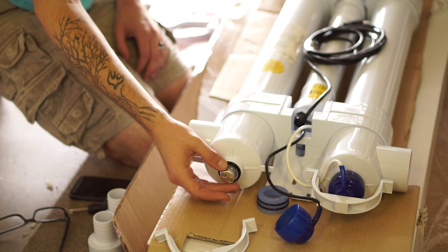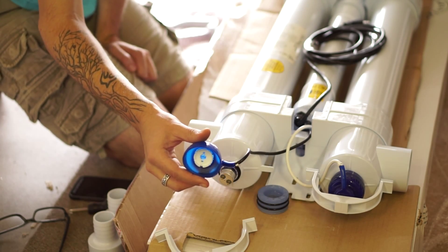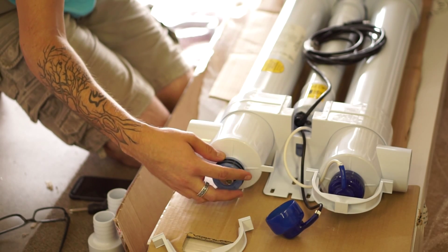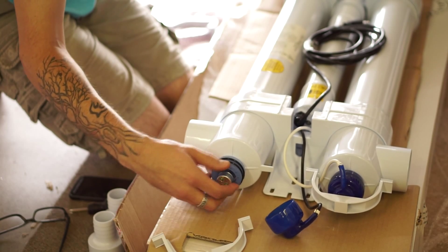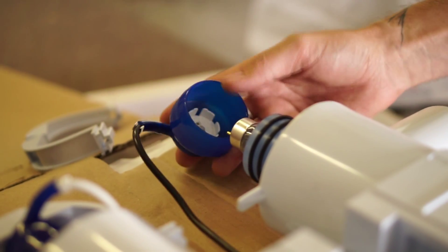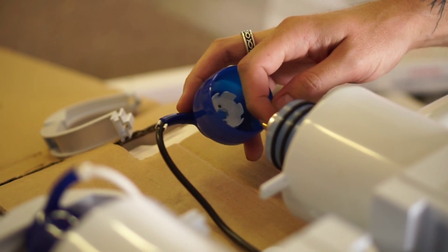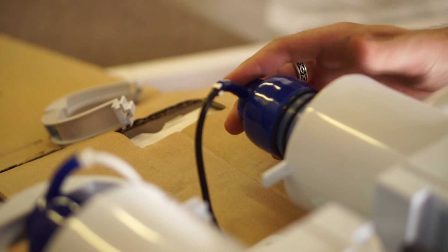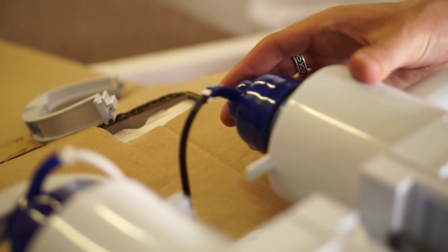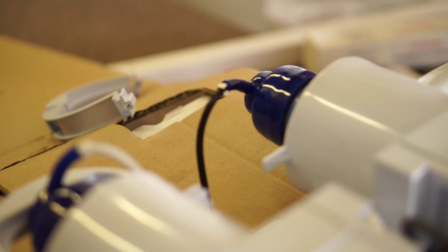Once you get the UV bulb in, you'll see that it sticks out of the unit about half an inch on each side — that's where your contacts are going to go. You're going to be lining your two contacts up in your end cap to your bulb. Before you put the end caps on, the important part is making sure this sleeve goes over the bulb and screws back into the unit, as this is really what's going to hold the bulb and end cap in place. Screw that on and make it snug. You have the two prongs here — you line them up with your bulb, twisting and lining it up. There's a little pop, not too much but enough to let you know it's connected. Then you can pull on the bulb on the other side and know that it's not going anywhere. Do the same thing to the other side, then you can test it with power.